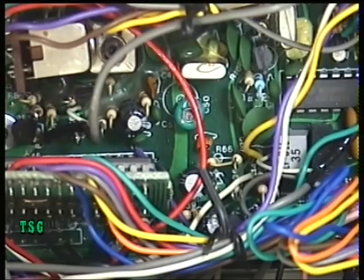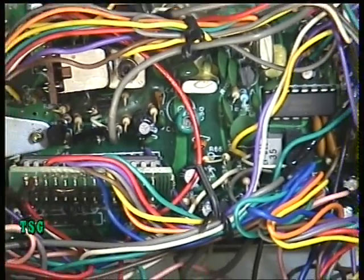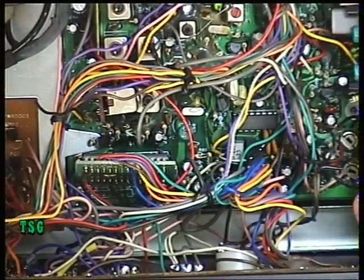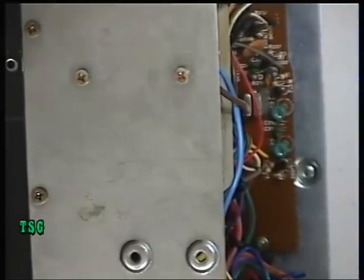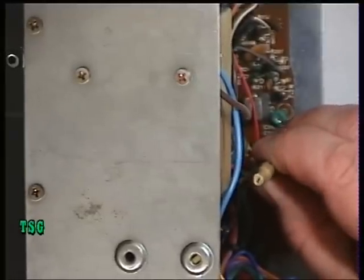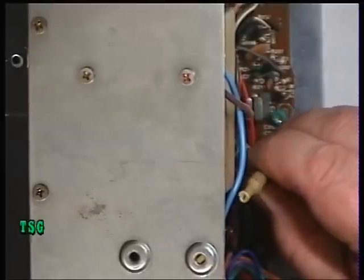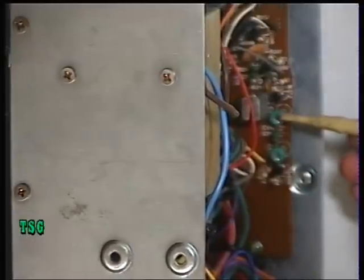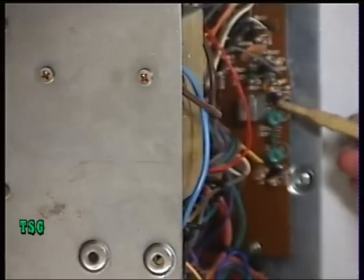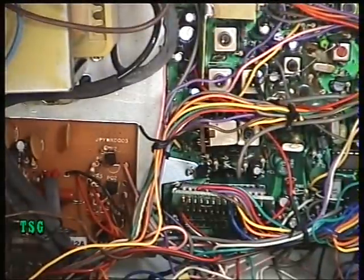So what we're now going to do is make sure the transmitter is actually on frequency. Transmitting — we've got 27.79133. Well, to be honest, that's spot on isn't it? It should be 27.79125 — it's slightly high. Just to prove I've got the right adjustments: it's capacitor C212, which is that one. That's your transmit trim, and that's receive. So 27.79127 now. That gives us a bit of latitude for the frequency dropping with age.